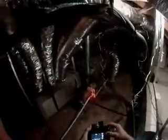We're now going to do an inspection of the attic. This is the attic inspection. We have plastic covers on the electrical outlets, they shouldn't be plastic, they should actually be metal in an attic. We have no insulation on the P-traps.